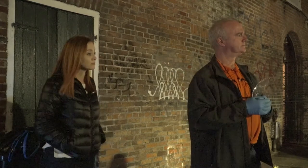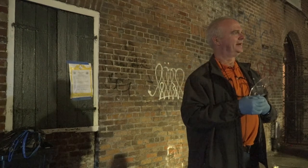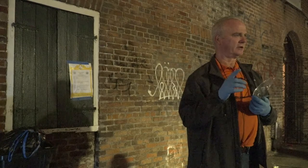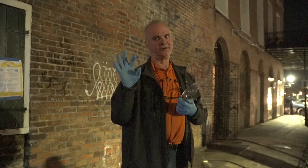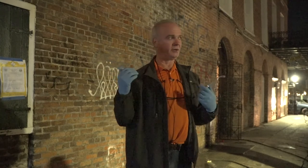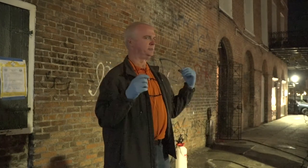Yes. Protection, is that advisable for interior brick walls as well? A version of that product is being made right now and for sale. It's called Masonry Dust Proofer. It's a silicone-based, water-based product, and it's made to stop the dusting on the interior walls. We've tested it several places. We're getting good feedback. We've actually had some people buy some here and put some up. I haven't chased it down, but it's a silicone-based Masonry Dust Proofer. So it's a little bit thicker than this one, but it's water-based, so there's no smell.